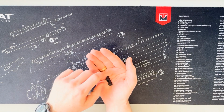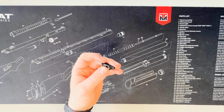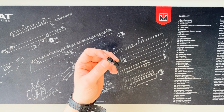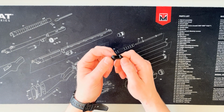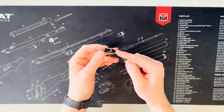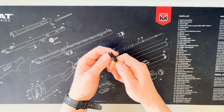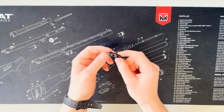So in the kit, you'll receive the sight itself, which is machined from solid 6061 T6 aircraft grade billet aluminum with a hard black anodized coating. We also offer these in red. It's got multiple smooth ergonomic faces, so you're not going to rough up the webbing of your hands, particularly if you're shooting something like a Shockwave. There's no hard or sharp jagged edges on there. We've also designed it so that no matter how your thumb lands on this switch, you're able to actuate it. There's multiple actuation surfaces.